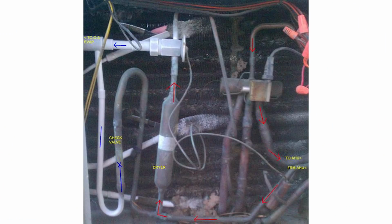I believe they went to Parker Sporlan. The previous ones, they would have a bypass and a check valve, and in order for the gas to work in heating mode, you had to bypass the expansion valve, and it would just literally loop back around the opposite way. When it was in cooling mode, it pushes that check valve in, stops it, and forces it to go through the TXV on the inside or the outside, depending on what mode you're in. That is how the check valve works, because there's one inside and outside on the older equipment.